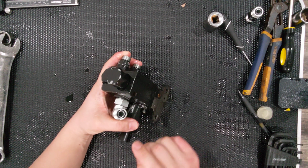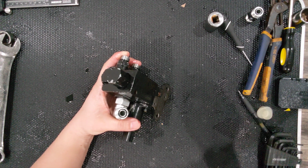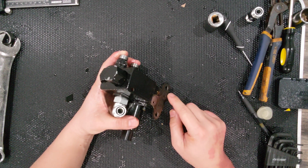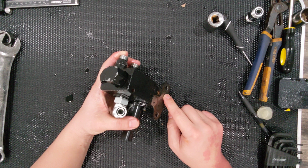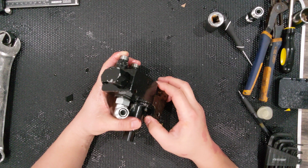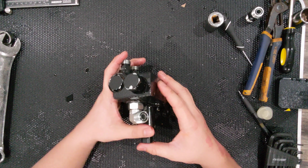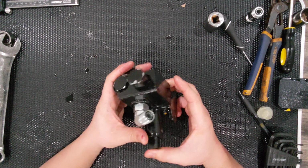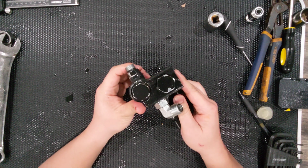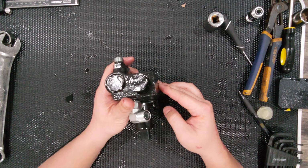If that is satisfied, and there are a few other things, like do you have everything in the right position as to whether or not it'll actuate, then pressure will come into this port here, which is on the side of the transaxle, and that's what allows the PTO to engage. So if you think about that, this is a lot of stuff in a single block here. It's nicely designed, I would say. But I do think it's undersized based on what the tractor puts out.